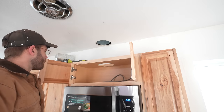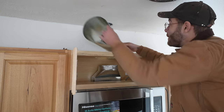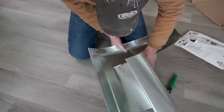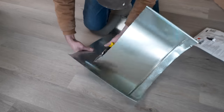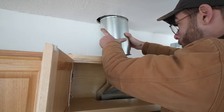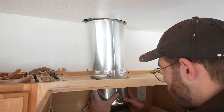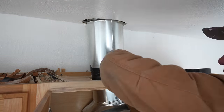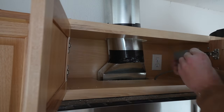I had never ducted any appliances before this, but I found out it was really easy. The adapter for the microwave just sits right on top. Since I couldn't get one single piece into place, my plan was to cut down a couple pieces of ducting so I could do it in steps — one piece about the same height as the top of my cabinet, and a second to cover the distance between the elbow and that first piece. I'm using tin snips to cut them. All of the ducting angles slightly left to align with the microwave and vent, and I put a lot of duct tape on each of the seams so there will never be an air leak. I couldn't wrap with full pieces because the wall was so close, but I got a good seal.